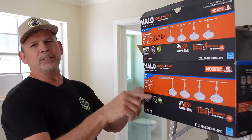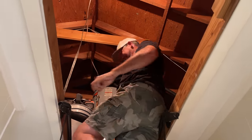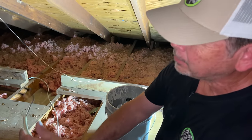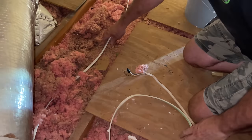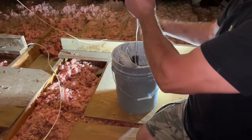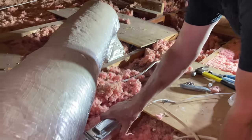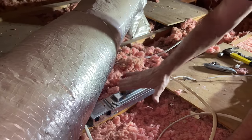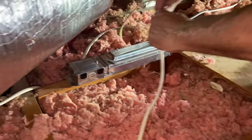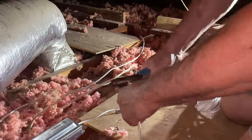Let me gather the few tools I need and we'll head into the attic — our goal is to get in and out in five minutes. Here's our switch leg from the old fixture in the middle of the room. There's nothing wrong with this cable; it's got a ground and our electrician saved it up here. Here's the new 14-3 we ran to our fan. I'm liking this location right here for our power supply — it's protected by the ductwork so nobody's going to trip on it. I've got quite a bit of cable so I'm going to loop it around.